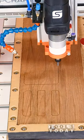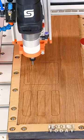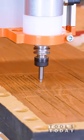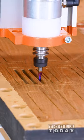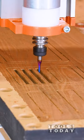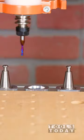I'm making a desk organizer here on the Stepcraft M1000 CNC, starting off with a 1/16-inch point round-over bit to go through and round over all of the edges. I'll follow that up with an 1/8-inch down-cut bit to cut the slots for the SD cards and USB holders.